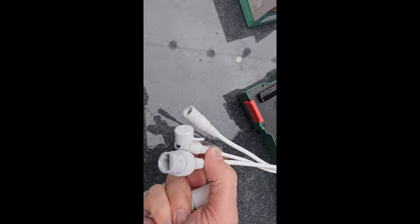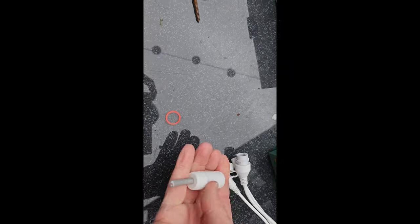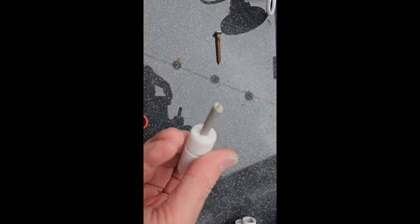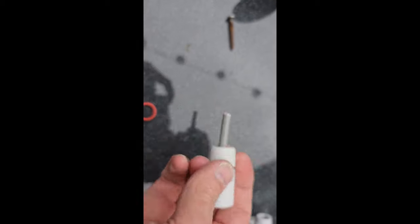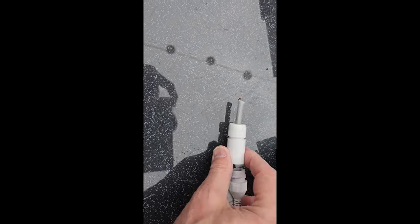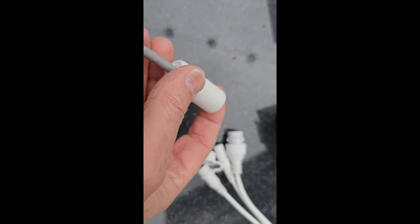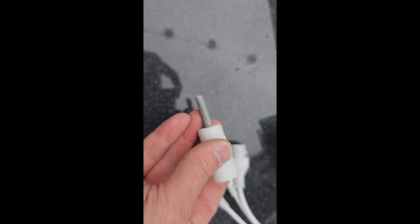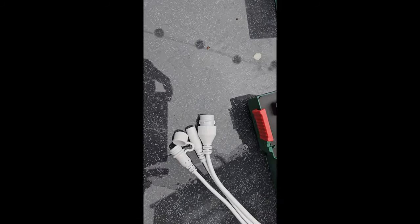The other thing to do, if you're using Wi-Fi, then obviously you don't want this getting water in it. So what we do, use this end cap with the washer and always put a little bit of cable in. It doesn't have to be network cable, just any cable that plugs that hole. And then when you screw that on there, it actually makes that waterproof. Then it also stops any spiders and things making it their home. So just put a little bit of blanking cable in it or silicon sealant, anything like that, once you seal it up, and that just makes that then waterproof.